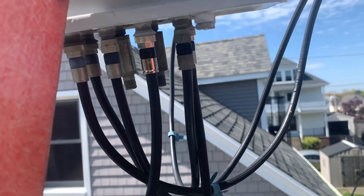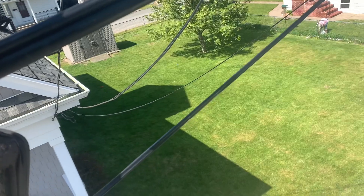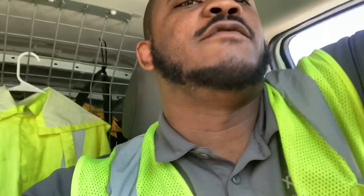Got the F-connector hooked in. My RX came in at positive 16 dB — that's really high. This drop is maybe 50 feet of cable or less, so I might have to put something in the home to make sure that downstream isn't too high. Wireless Xi6 is installed. Just got that job finished — it took a while to close out, fighting with dispatch and all that, but signals are good, CPEs passing upstream and downstream. On our way to the next job.